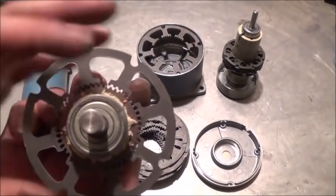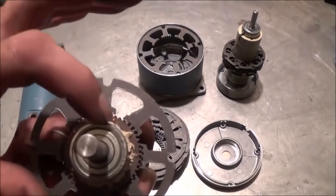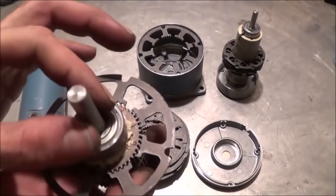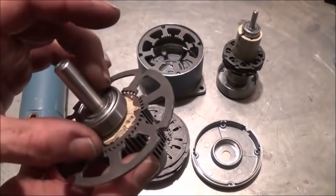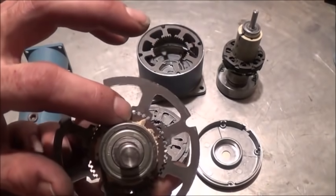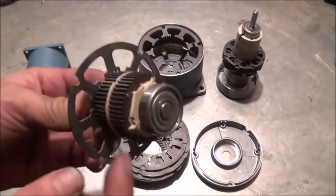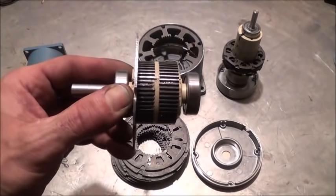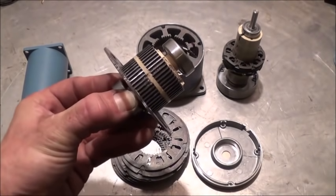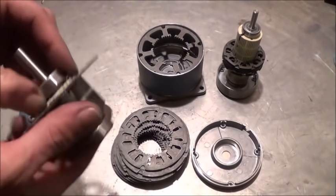What I'm going to do now is line each one of these up. I'm going to start out with all the teeth on the internal rotor and the external ring lined up so there's an output hole in each one of those. You'll notice how nicely it creates that air grab area right there at the center where all the energy is coned down — at the very center of a Tesla turbine where normally you've got very thin or no blades at all in a smooth center. I'm going to use probably a thicker construction paper or something made out of plastic to separate each one of the layers of the rings. I'm going to stack a bunch of these external stator rings all the way from one side down the center to the other side.